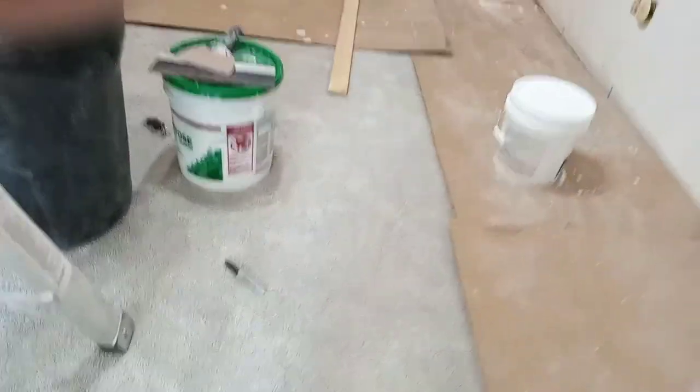Let's go ahead and paint it and see what happens. That's just the first coat, and zooming back in, it looks pretty good. You really can't tell there were areas with more joint compound — it looks like a fairly even wall texture. I figured that out through trial and error, but it's a pretty good method. You have to overcome the thick blob problem by doing one more pass with the spaghetti roller.